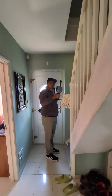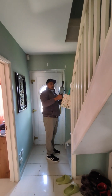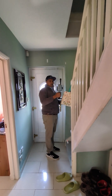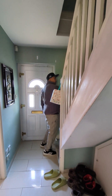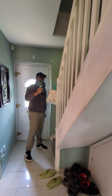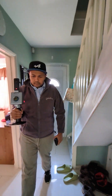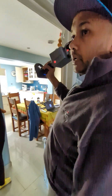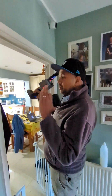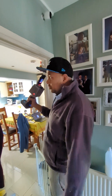When going up the staircase, it's best to go at an angle because the scan point is going around on this surface. I normally just go at an angle going up the staircase. Again, when going through the door, put it at an angle to get a better reference for both areas, especially if you're changing to an environment that's quite different.